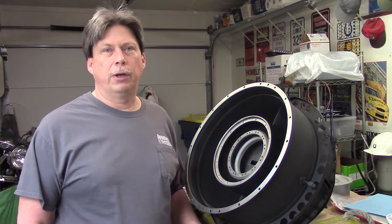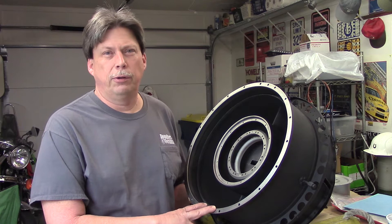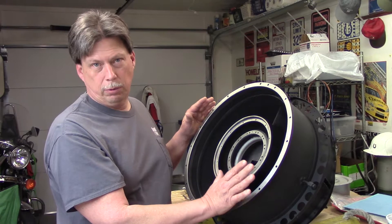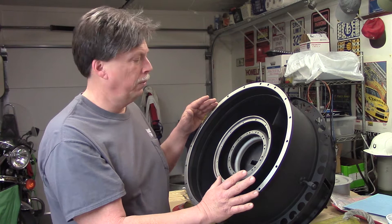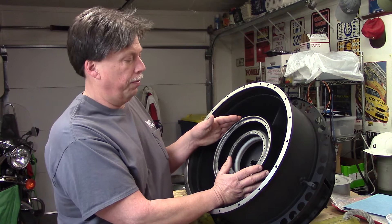This next set of videos will involve this big piece here. The manual refers to it as the exhaust nozzle assembly. This flange would be toward the front of the engine and attaches to the back of the cowling. From here on back involves the turbine rotor assembly — in this case a one-piece blisk. B-L-I-S-K is a combination of blades and disc, welded to the rotor disc making it more or less a one-piece assembly. The turbine shroud is in this area, and here we have the turbine bearing support and housing.